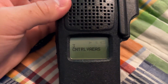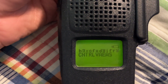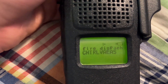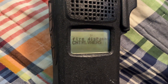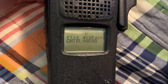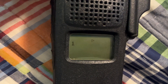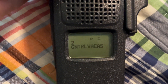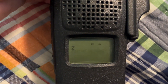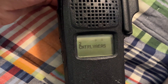All right. Now: 1, 2, and 3. Notice the zigzag icon right there — that means it's on a scan list. This channel is not on scan. When you're on the TAC channels, it's going to scan to fire dispatch if there's chatter. If I'm on 1, it goes to fire dispatch. If on 2, it goes to fire dispatch or to 1 or 3. If on 3, it goes to 1 or 2. Whenever there's a transmission, it's going to go to that channel and listen.